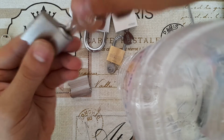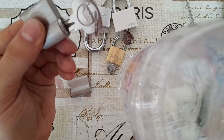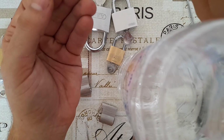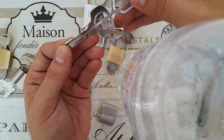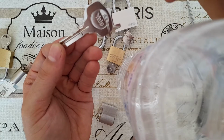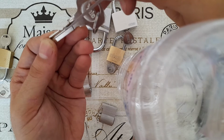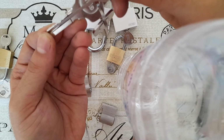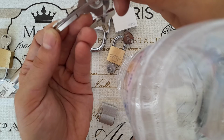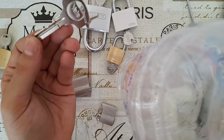Again, you can do this. Put your key, mark it, take it out. Watch your hooks. When I'm picking from the warding, this part of the key is basically not existing. I need to measure it from here. First pin okay, second pin okay, third pin, you see, oversetting the second when I set the third. I'm not even going to try the last two pins because they're almost max lift.